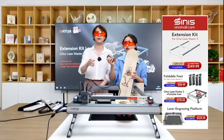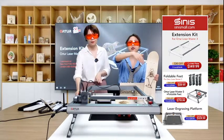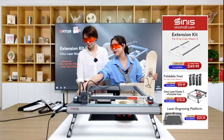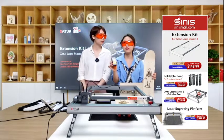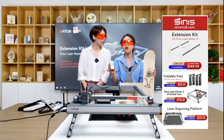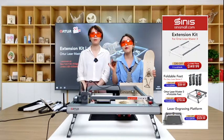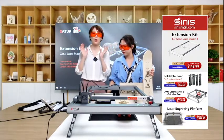Okay, so we can introduce the laser machine again. The size is 400 by 850 millimeters, and with the extension kit, 1500 millimeters. The laser module is 10 watts. With this 10 watts, it can cut 10 millimeter acrylic by one-pass cutting, and also 10 millimeter pine wood by one pass. It can also cut 30 millimeter acrylic by multi-pass cutting. So besides very powerful cutting, it also has a very good engraving effect.